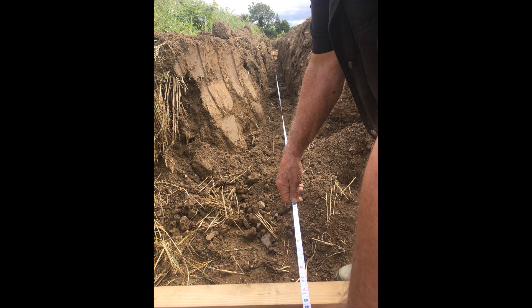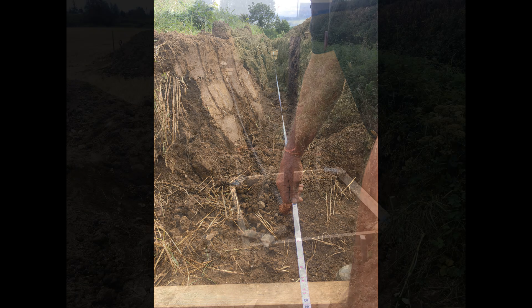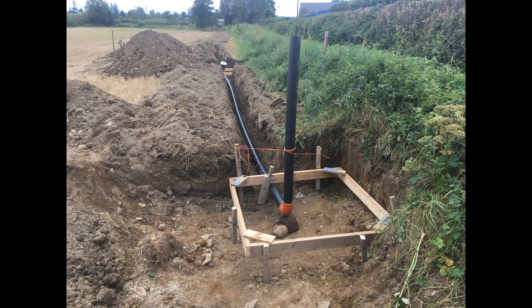Because we had spent so much time planning our pipe route, we now knew exactly where to excavate for the collecting tank and the pump chamber. For these two structures, we needed to shutter off an area for reinforced concrete pads. If you are intending to install a pump yourself, please take note that the overflow for the supply tank and water pump chamber exhaust pipe must be installed at this stage before any concrete is poured. Remember, if you make a mistake at this crucial point, then tears will surely follow.